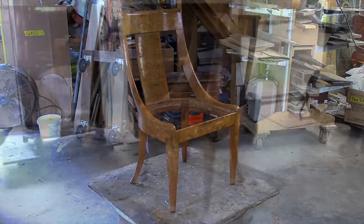So this little pad looks to be just about 3/16, maybe 5/32, say. And the high point of the foot is about the half inch mark. I've got my lines marked, so now I can take away all this wood above this line, and I'll just kind of do this by eye for a while, looking at the other feet as I go along.